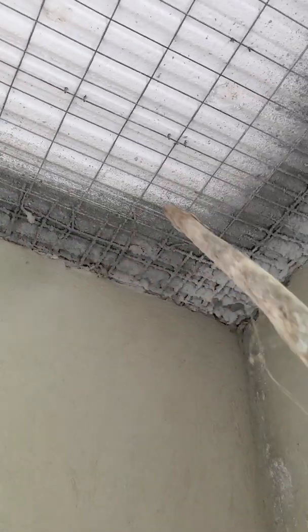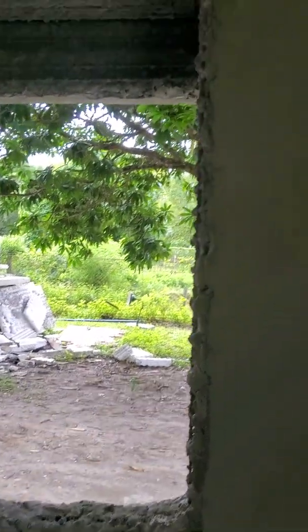So this is my plan: we are going to do a PVC ceiling, which changes things a little bit. We went to a place called Wilcon, which is a construction supply company. What we need to do is put some hangers in here on the two-by-fours, and then every two feet or so when doing the ceiling furring, we'll need a piece going across so we can screw or rivet the PVC ceiling tiles.